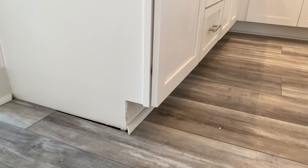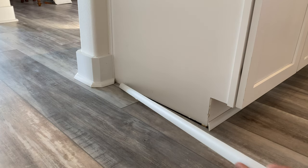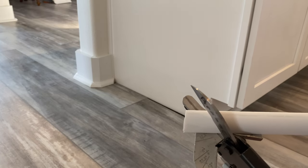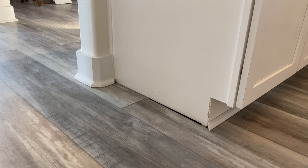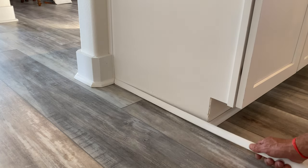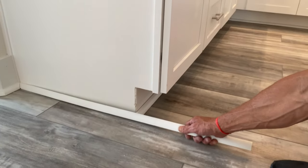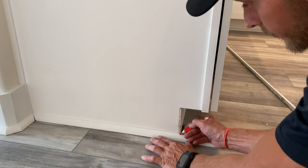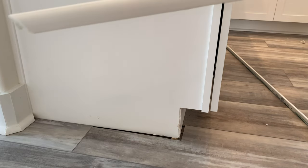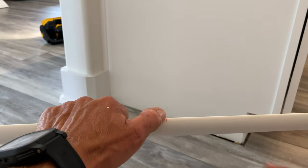Find another short piece close to that length and go ahead and cut the 45 for the back corner first — that's the inside corner, so again 45. It looks a little rough but once you put it together it looks much tighter and cleaner on that back wall. Back here to the front we're going to pull that piece out and mark it where the wall trim ends. This is going to be another outside corner, which means that needs to be my short point, and over here is going to be my long point. These are all 45-degree — most houses are going to be 45.